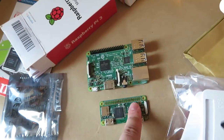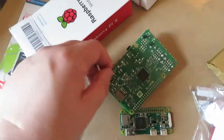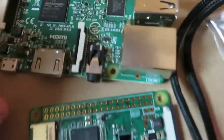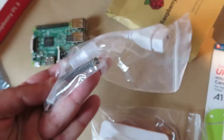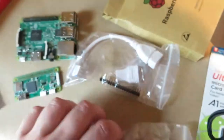You can get them with the pins already soldered. There are two different ways of powering this — it has to be 5 volts. You can either power it by soldering on a couple of pins on the back, via the USB power in, or from a couple of GPIO pins. I'm probably going to do it through those pins on both of them, even on the one that doesn't have the pins soldered on yet. I'll get a good case for it, some cables and pins — none of which I'm really going to use, but it's cheaper than buying the Pi on its own.